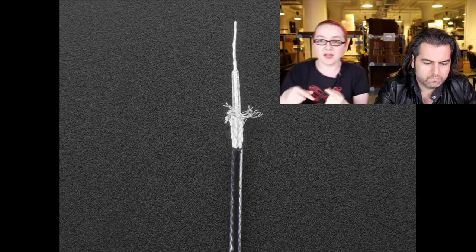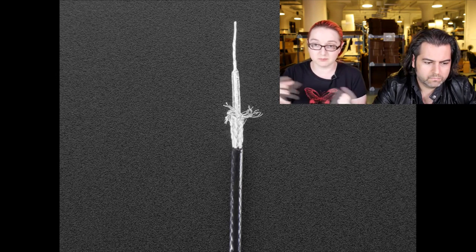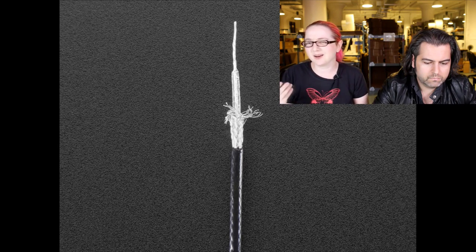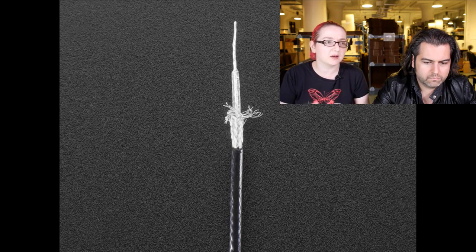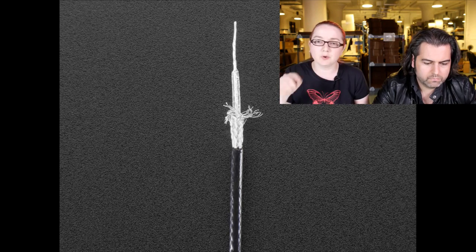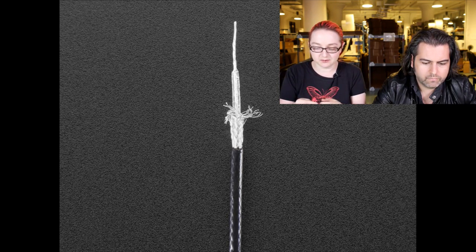And then over that, there's an overbraided sheath. So it's actually got a grounding braid on it. In general, this is used for EMG wires, EEG wires, or biomedical instrumentation, or RF sometimes, although it's pretty thin. I do see it used for little UFL to SMA adapters and such. But the wire is super thin.